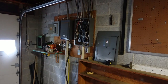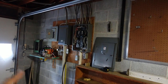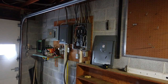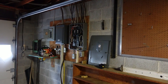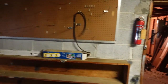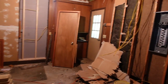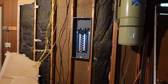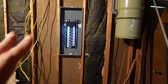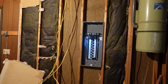When the inspector was here, he told us exactly what we expected — that the whole electrical area, the panel, and the service entrance are all a disaster. It's unbelievably bad and there's no way it would pass inspection. So we're going to have to completely replace the panel with all the circuit breakers, completely replace the service entrance, the mast, the meter, the whole bit. Instead of doing it out there, it makes more sense to put the new service panel right here, much closer to the house — right there by the door into the kitchen. Barry has already started running some of the wires, and it'll mean much less wiring than running all those circuits all the way out to the garage.